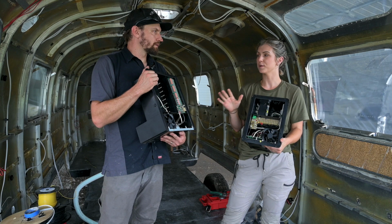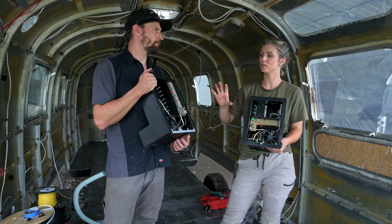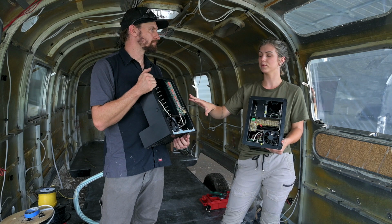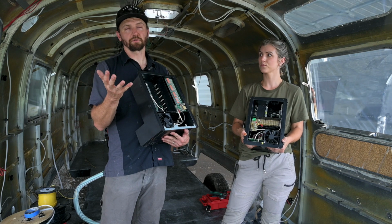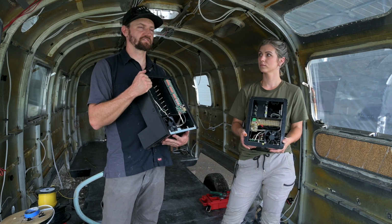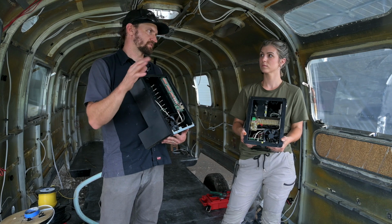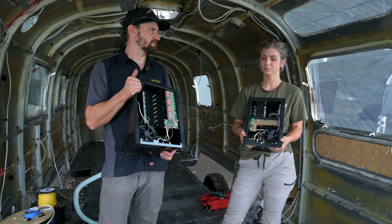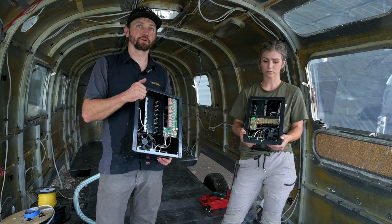So it's still a matter of capacity, what you need. Yeah. If you have the solar, then you're looking at different parts to make the solar work with this. Exactly. And typically with the 50 amp, those parts are more expensive. Correct. The Magnum inverter that's the 50 amp 3000 watt is about $3,000, whereas a 3000 watt Renogy or something like that is closer to 1,000 to 1,200. The Magnum is pretty much the best that's out there. So you get what you pay for, but there definitely is a higher cost whenever you're going to 50 amp versus 30 amp.